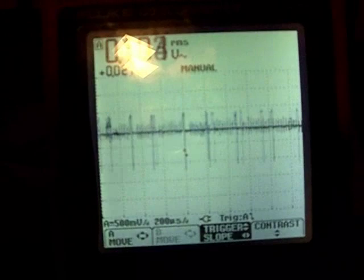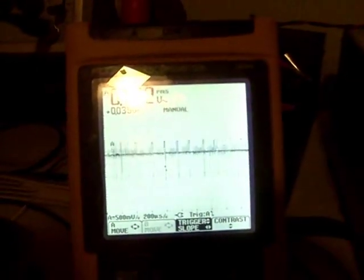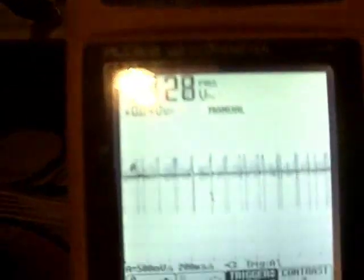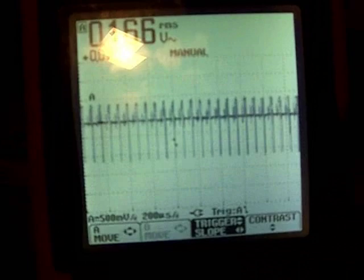The gate resistance will do that as long as the frequency is not too high. If the frequency is too high — for example, if I increase the frequency — what it does is bring the pulsing close together and it basically squashes out the oscillation.